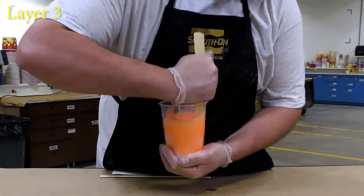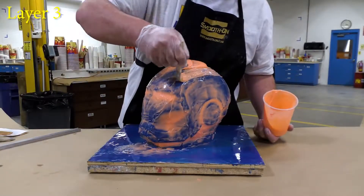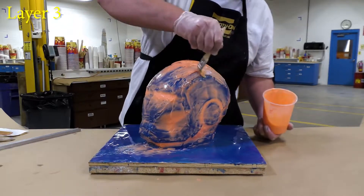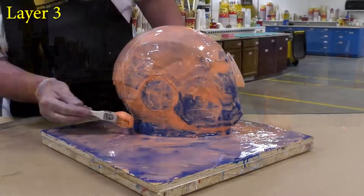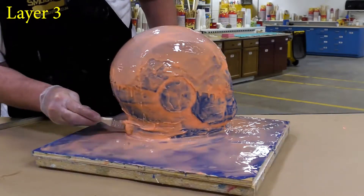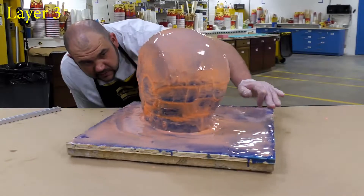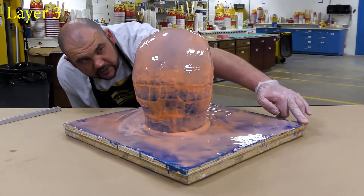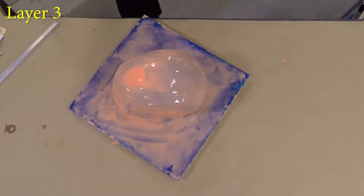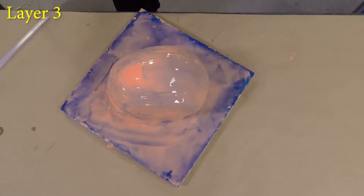Now working on the next layer, we're going to again mix some material and apply it over the entire piece. Notice I'm not adding any pigment here — I'm simply focusing on the areas that are dark blue and covering those with one layer of rubber. Then one quick visual inspection to make sure everything is covered. The material is now allowed a partial cure for 60 minutes before moving on to the next step.